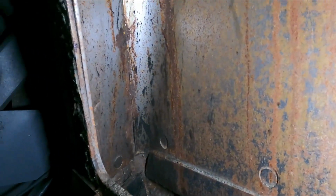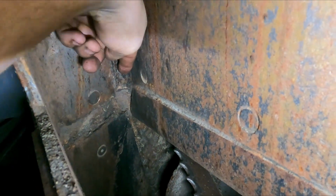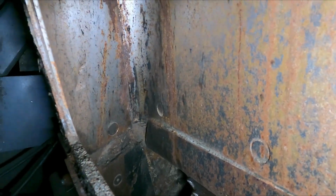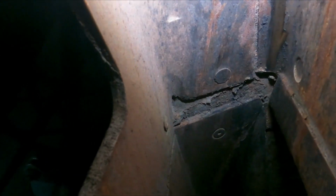The next important thing is to check the wear plates in the chute, and where they start wearing away is in the corner here, and it'll start just pulling up from here and going upwards. The same is for the front. It'll start in the corners. We can actually see some wear there, I think. Can you see it? Move the light. You see that in the corner?